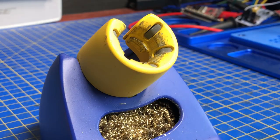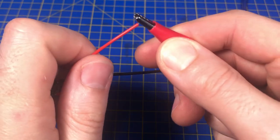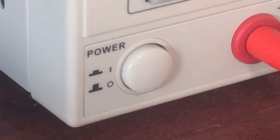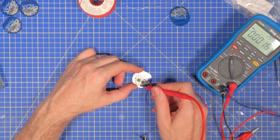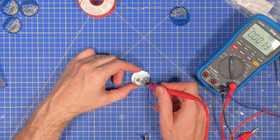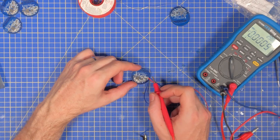So the next thing to do is to test. If you remember how I designed this device, it was in a series of blocks, and each block can be tested in turn. The first block to test is the power supply one because, frankly, if that doesn't work, nothing else will. To test this, I first need to solder the battery and a few power leads to the board. Got some power hooked up to it — let's see there's five volts coming through. Let's test the output of the voltage regulator. VDD is this pin here — 3.3 volts coming off that, so the power circuit seems to be working.